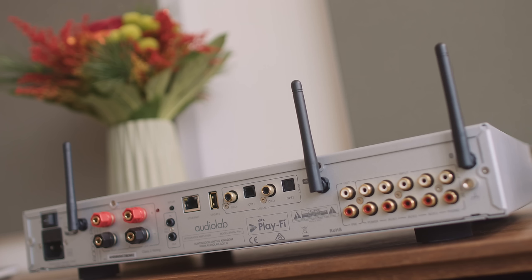So here's the good news: Audiolab make something called the 6000A — which still has the phono stage and the DAC but doesn't have the DTS Play-Fi module — and if you buy that you save €250. That €250 can then be used to add your own streamer to the internal DAC. For example, Argon Audio have a streamer that does Roon, Chromecast, and AirPlay for $250 — it's Wi-Fi only but apparently very good. Or you could add a coaxial or Toslink HAT to a Raspberry Pi as a mini streamer. You could add a Chromecast Audio dongle, though that's not gapless either, but the gaps are smaller.